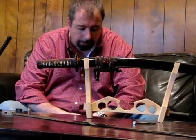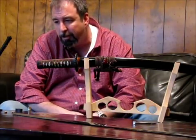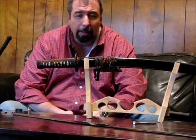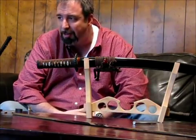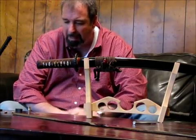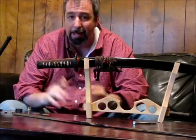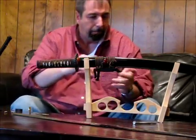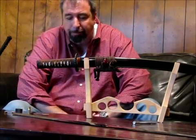When you get different series of steels, like say 9260, you're getting a steel that has more silicon in it, which supposedly adds the flexibility. When you get something like 5160, that's also again a different series of steel, and I don't know what's added to 5160 off the top of my head. Maybe manganese is supposedly good for shock absorbance. So these are specialty steels.